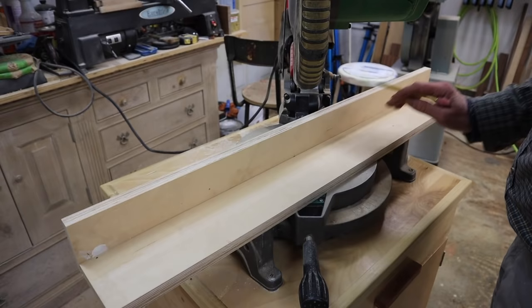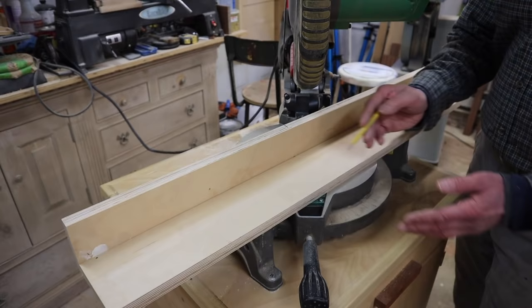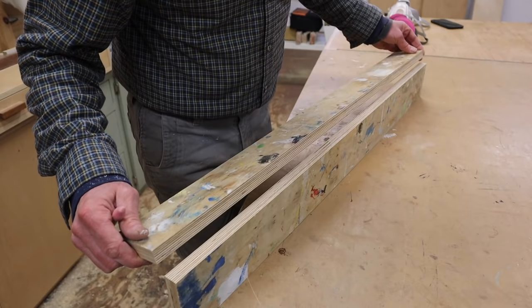The new fence will be attached to the saw like this. First I'll have to attach these two pieces, but this is a good way to just make a few marks to make sure you don't put any nails where the saw blade is going to cut through the sacrificial fence. The reason why I don't make the platform too deep is because you still need to be able to read the numbers on the saw. In this case the platform is 3 and 3 quarters and I can still see that the saw is set at a 45 degree angle.